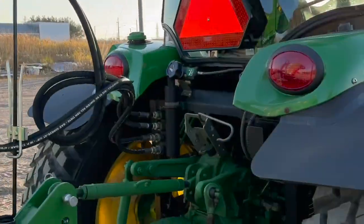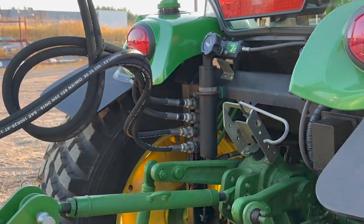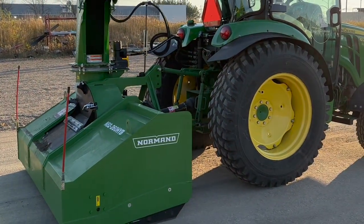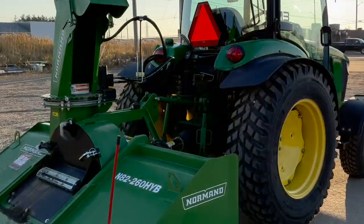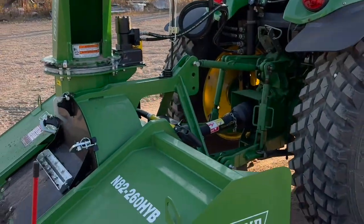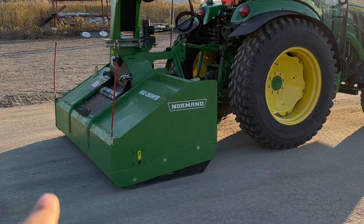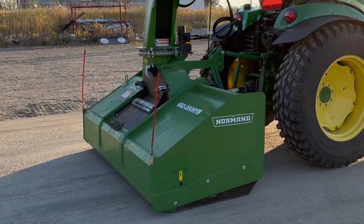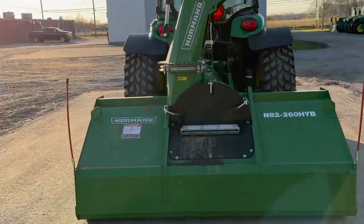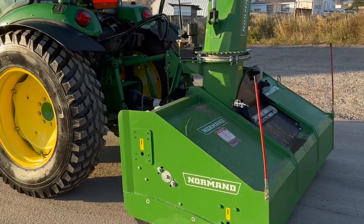Getting into the back here, right up here you got a hydraulic accumulator — that cylinder right here. What that cylinder does is it absorbs the shock for this large blower on the back when it's driving down the road, so that you don't bust a three-point hitch or blow an arm out in the rear end. That shock absorber is essential if you're going to be running any sort of inverted snowblower that weighs over a thousand pounds. This blower is about 1,200 to 1,500 pounds — well over a thousand pounds — and you do need a hydraulic accumulator.